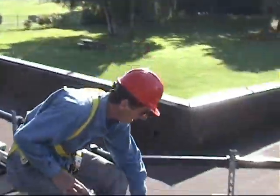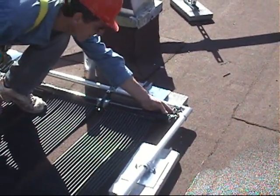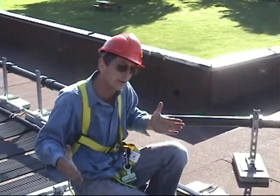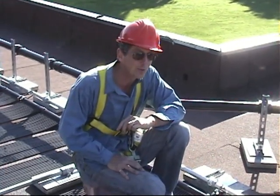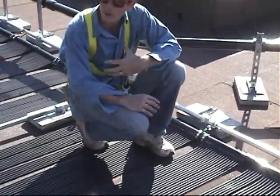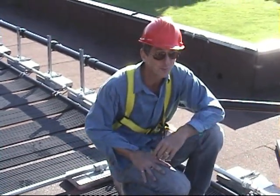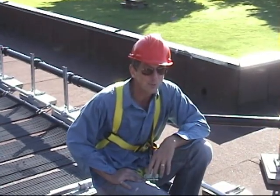The headers are attached at every rubber coupling connection and at the end we've used a hose clamp, a strap bracket, and a strap to make sure it doesn't pop off. We're holding the headers at both ends. You can't do that with any other type of solar panel — if you hold the headers and prevent the panels from contracting when they cool, you'll rip anything apart, including EPDM rubber, because the pull is too strong. But with our plastic-based material you can do this, which satisfies structural engineering requirements. Holding both ends is far more secure than letting one end free-float, and that's a unique, subtle advantage of the power strip system.